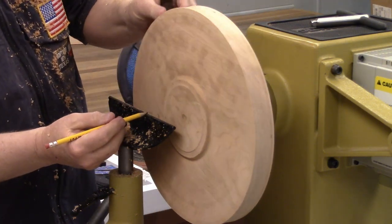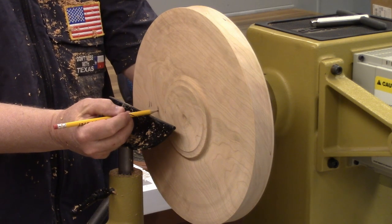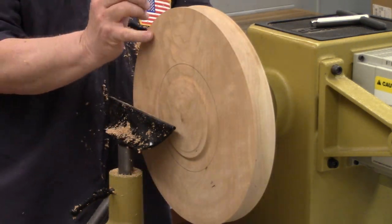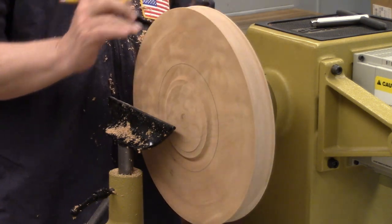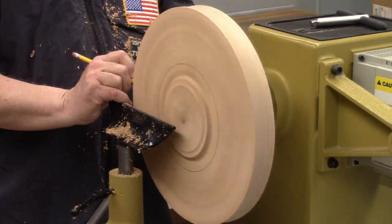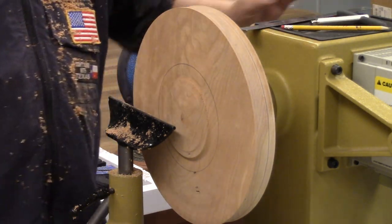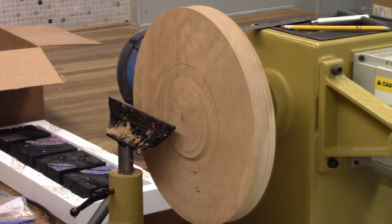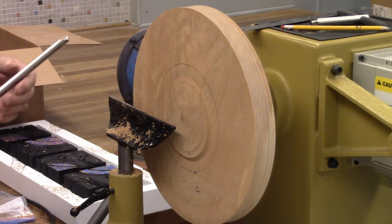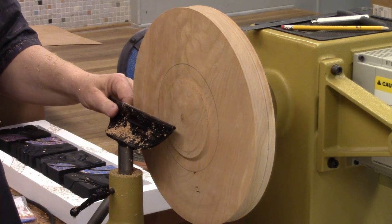And so I slowly start the lathe up. So this measurement, this is the one I'm going to work off of right here. Okay, and here's my mark for my lip. This is literally how I do every one of them now. So I know where I'm going. And so from there, I'll take my bowl gouge, and I'm going to start doing a concave cut. I'm going to create a concave shape. Because I always fretted on how to do this, and he's made it easy for me, at least to lay out.